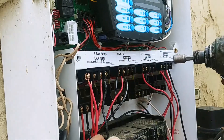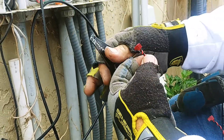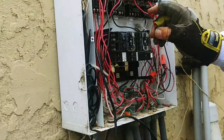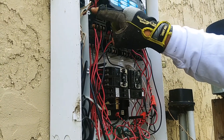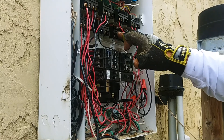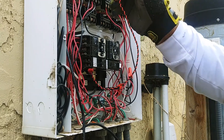On the Hayward you're going to have to remove this metal bar. Also on the Hayward, these aren't going to plug in where the wires feed the relays — so these are a little different than the Jandy. On the Jandy you just plug in on one side, plug in on the other and you're done. On this one we're going to have to land the wire on the top of the relay exactly as the wire that's currently there, black and red. We need to determine which relays we want to use for our speeds — the filter pump has to be one of them, and then we have three more empty relays. I'm going to cut and splice this wire onto the top of each relay.